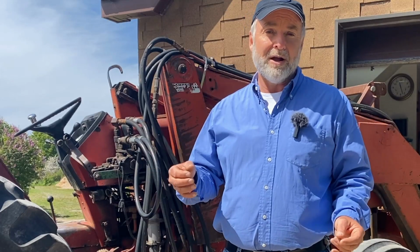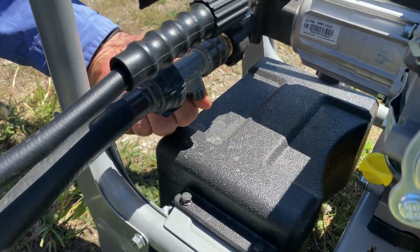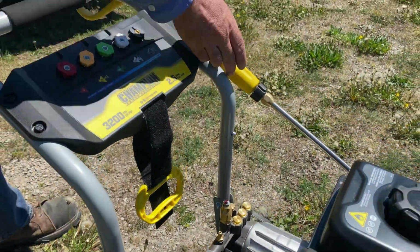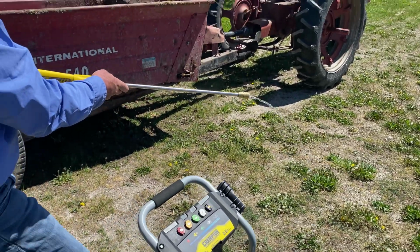It's also important that the engine on any pressure washer never run without the pump being filled with water first. This is why I always let the water flow through the pump until all air is displaced before firing up the engine. Simply turn on the water at the hose outlet, pull the trigger on the wand, then let low pressure water flow through the hose and onto the ground without the engine running until all the bubbles stop.